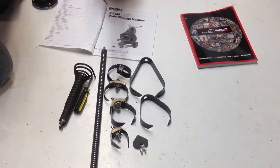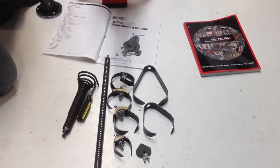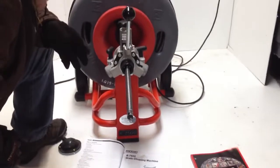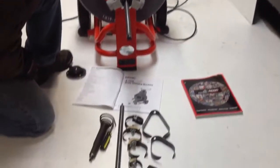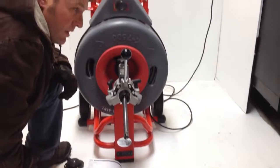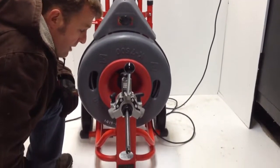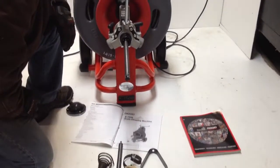You just need to tell us what size pump or pipe you're using, and we can give you the suggested tools for you to use. And the directions kind of say the same thing, which is it's basically user discretion. And so if you follow their guidelines, start with the smallest and work your way up to the largest, nothing bigger than 1 inch under the size of your pipe, you should be having no problems, and your drain should run again, and this machine should be finished.